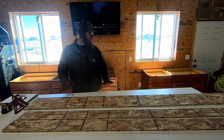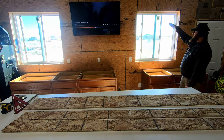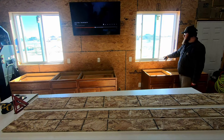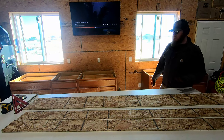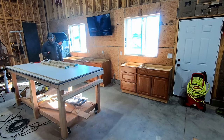I have these pieces ripped down. The box for this is four by four, so I'm going to do the bottom and top at 48 inches and the sides at 47 inches to account for the half-inch thickness of the plywood. I got those pieces cut, I'm going to move the table and cabinets out of the way and show you how we put this together.